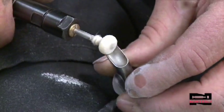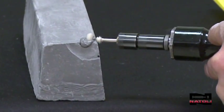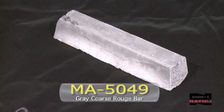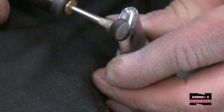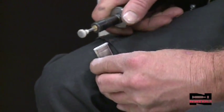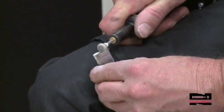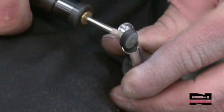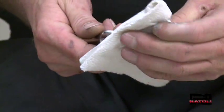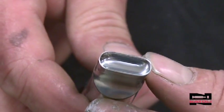Next, the polishing begins. Turn the machine back on and apply the gray polishing compound, also known as the gray coarse rouge bar, Part Number MA5049 in the catalog. Apply the compound and work the bob through your cup. Using this compound with the cotton bob will remove heavy scratches on the surface of your tool. I'm going to move the tool — I'm not going to move the bob. This keeps it nice and smooth. Use light pressure on the tool; let the bob and the compound do the work. When you feel you may be finished, wipe out the cup with a soft cotton towel and check your progress.